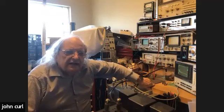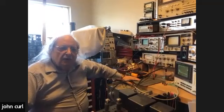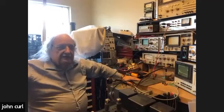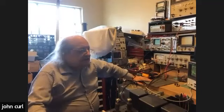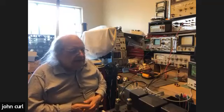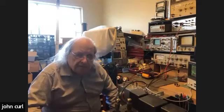Because they all have up to 10% distortion on the peaks, maybe 20%, maybe more. On the average, they have maybe 0.5% or 1/3%, just listening a little down, down, down, and then the peak comes up and it's 10%, and then back down. That is normal. That's typical. And it sounds wonderful. You say, well, man, Kind of Blue sounds pretty good to me. Yeah. And guess what? The reason it's so high is that there is no negative feedback in the magnetic tape system. It runs open loop. So whatever the tape has, you get. You can't fix it.